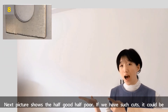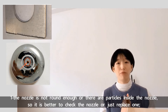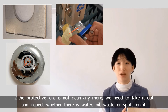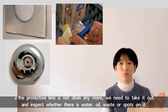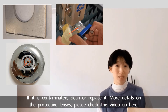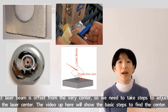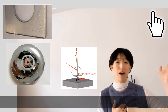The next picture shows a half good, half poor cut. If we have such cuts, it could be: number one, the nozzle is not round enough or there are particles inside the nozzle — it's better to check the nozzle or just replace it. Number two, the protective lens is not clean — we need to take it out and inspect whether there is water, oil, waste, or spores on it; if contaminated, clean or replace it. Number three, the laser beam is off-center — we need to adjust the laser center.